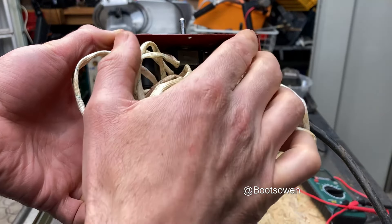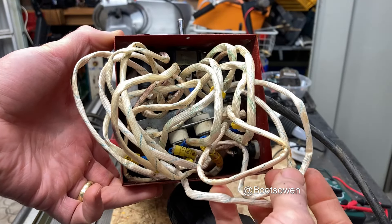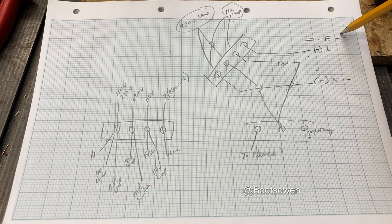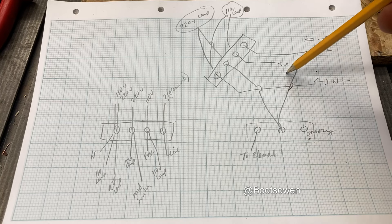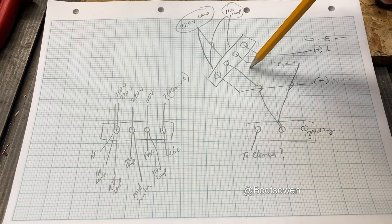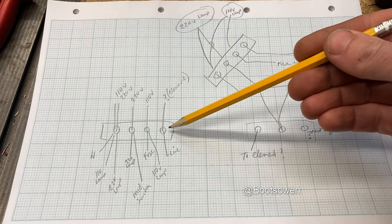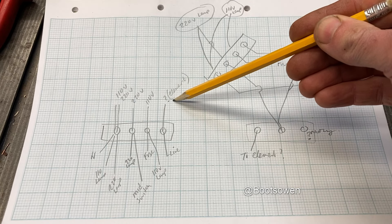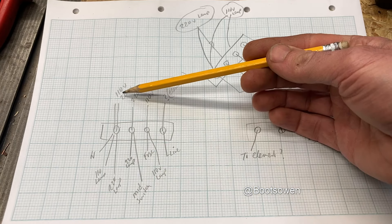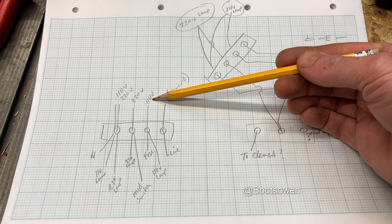The element I think is coming off these wires here in behind, inside in fiberglass or some kind of mineral wool. There's one of the neons going down to there. This is the switch up here, this is the power coming in over here. The fuse, and the lamps - this doesn't have any of the elements on it. This is the main block with the elements included. Live comes in over here and seems to go to an element - just one wire. Neutral is on this side directly in. You've got a wire called 110 and a wire called 220.